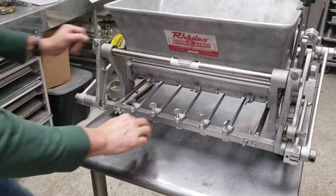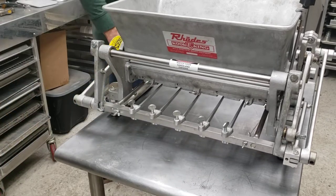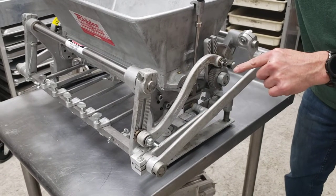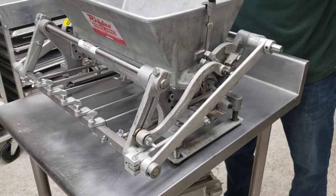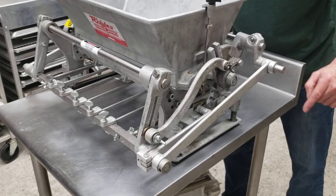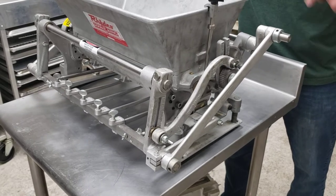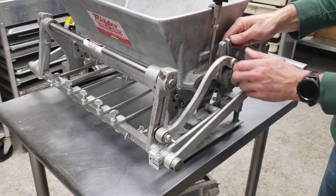On this side is our adjustment. Right now we are at the maximum — both positions down at the bottom is maximum. We can count: once we get a big click, that's the big click — 1, 2, 3, 4, 5, 6, 7, 8, 9, 10. We got 10 clicks, and that's how far our feed rollers will turn. The more clicks, the more the feed rollers return.